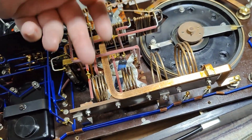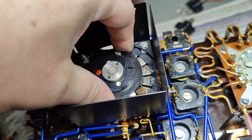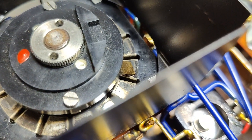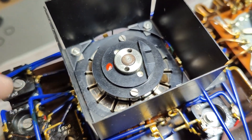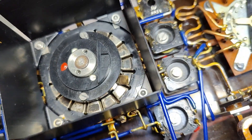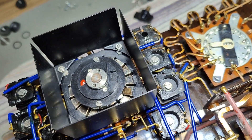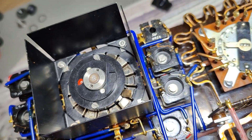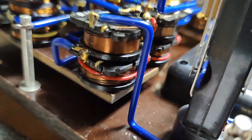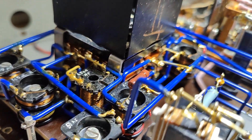Those two flip the other way around, so we can't really see the top. But we are lucky — this one is a double, so we can see the top part. This is how it works with a big, hefty blade that goes down here, and there are quite a lot of them side by side. They go all the way over and connect to the other side. When you turn this around, it grinds a deep connection down to the metal — you can see how shiny it is. This creates a super, super good contact with close to zero resistance. And those are all the different range resistors, made of all sorts of fancy wires. It looks like copper wire, but that is definitely not the case.